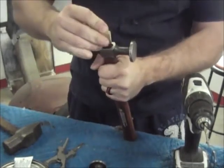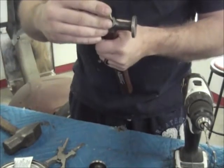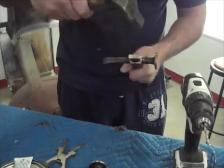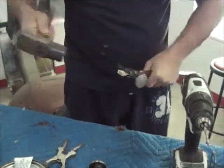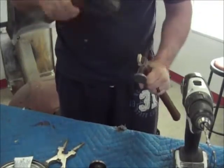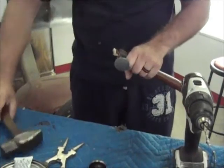Alright, got your wedge — I think it'll fit in there now. Also, you don't want to put it on your table and beat this down — it'll break the wedge, which is another thing I didn't know. I've learned a lot just watching a couple videos. There it goes — take it off the table and beat it in. Get it straight back up. They said run it in until you can't go all the way down, but when it starts cracking like right there, you're pretty much done.